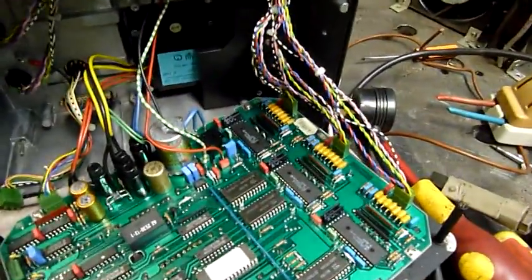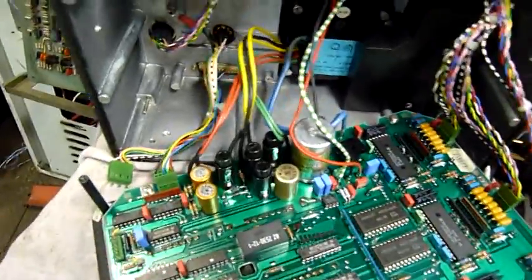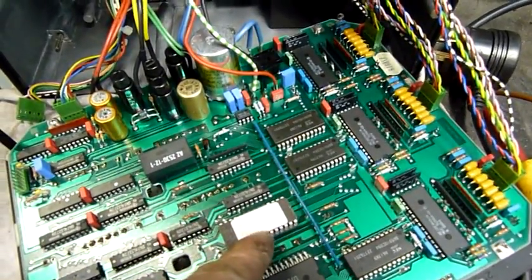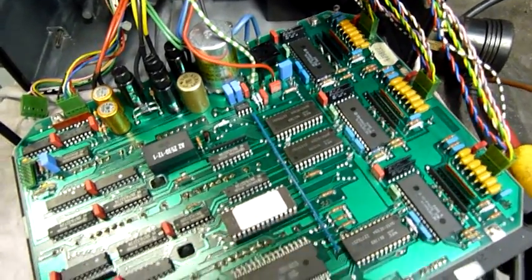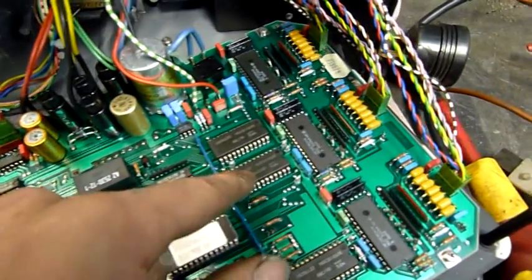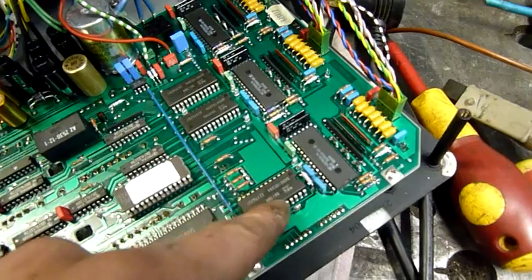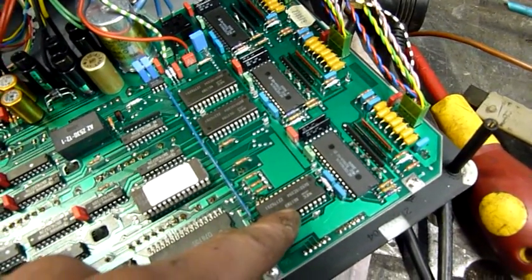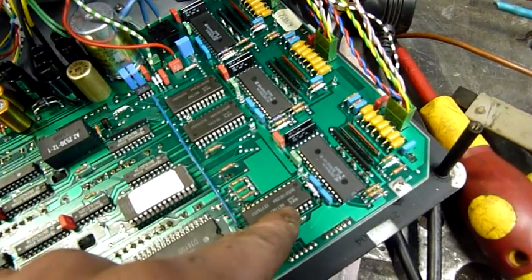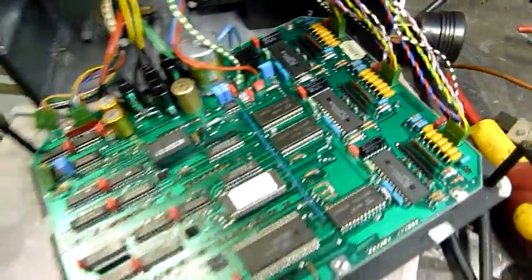I imagine the encoders would probably be interchangeable. They'll probably all fit into the same socket unless they've got one or two pins offset so you can't get them the wrong way around. That one there is just for an external communications port — I've just disconnected that so I can pull it out. Chip number on that one is 2129921H. Various Texas Instruments Portugal-stamped chips. NEC — that's an 8637H9. Same with that one — 8617H9. Slightly different. There are two 8617H9s and that one there's an 8637H9. Could be part of the display driver perhaps.